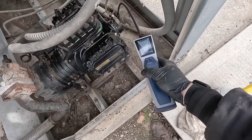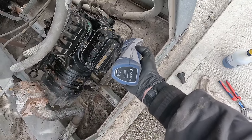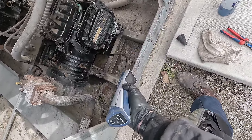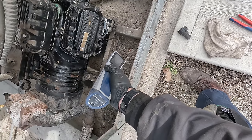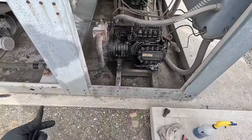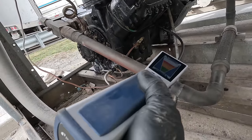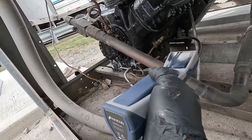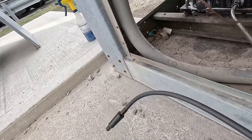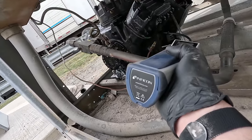Okay, it's running. Let's check the high side and make sure we don't have anything leaking out of that - which it does not appear so. Still getting a little bit down here on the bottom. Not sure what to do about that - we may have gaskets or something on the bottom that's got issues. Going underneath this head gasket here, picking up stuff on that - which is lovely. Compressor just shut off. Is it short-cycling? It was earlier when it was low on refrigerant. Looks like we might have got some leaks around the head gasket, which would probably explain why we had such a freaking mist before.